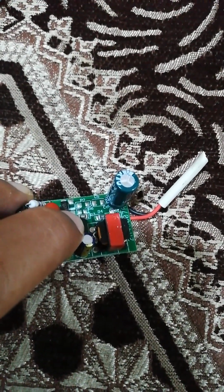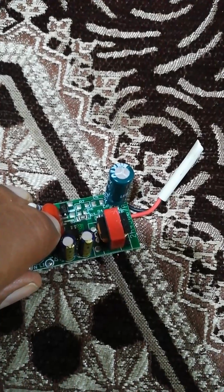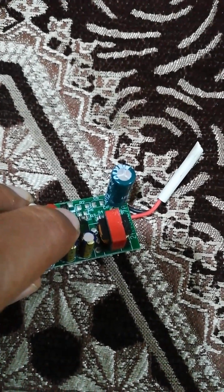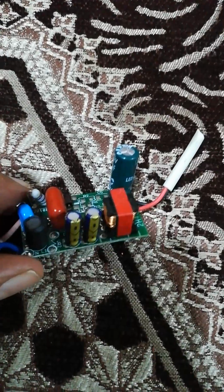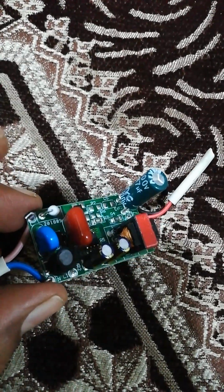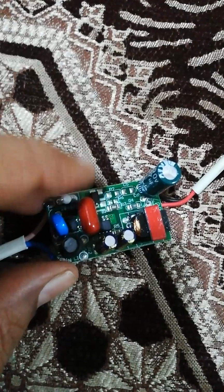Now what else? You see that there is a very small printing here, and that is a resistor, R7, R6, R2, R4. You can see clearly those are the surface mount resistors, SMD devices. So this is a small black resistor, that is a surface mount device or resistor component. Similarly, you see C5 and C6. Obviously, one of these is a capacitor. C indicates capacitor, R indicates resistors. Okay, and here also you see that there is VR2, so you need to know what that VR2 component is. I think there is this special device also, the black one. You can just use the microscope and see the details about that component.